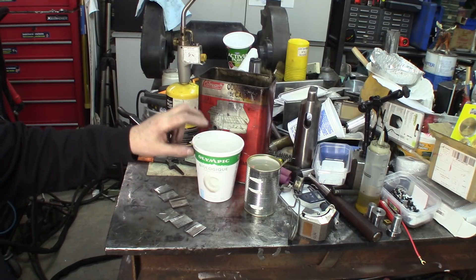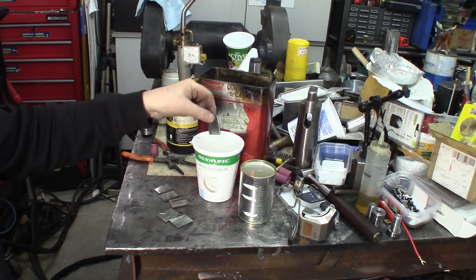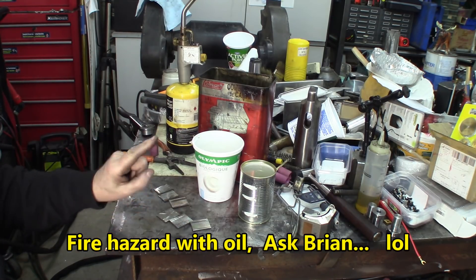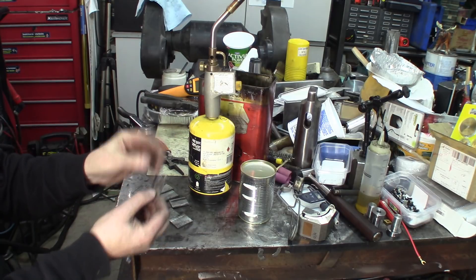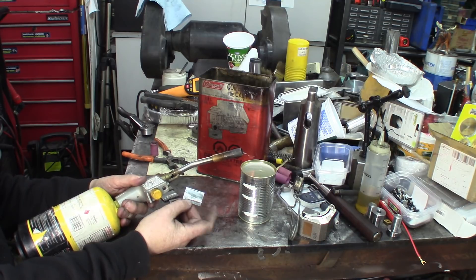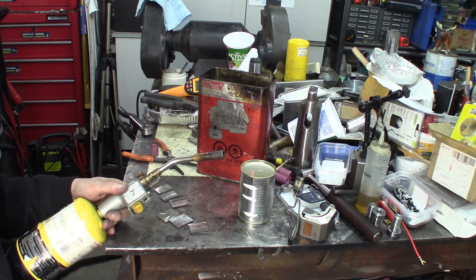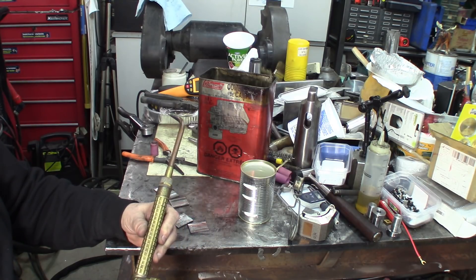Here are the options: my oil can, and I've got a water can. One of those red-hot pieces dropped in there — even if it's full of water, it may just make its way out of the bucket by making itself a hole. So none of those, please. Now we have to heat these pieces up. It's not a very big piece, but heating this up completely with a small torch takes a long time — it needs a lot of energy to bring them red hot. There are some bigger torches with a much higher BTU output, which would be a good suggestion. The other option I'm going to use is the oxyacetylene torch — not a big one, but that's going to be good enough.